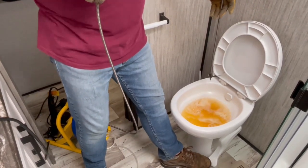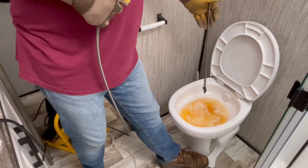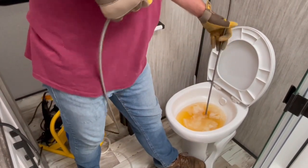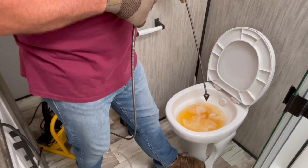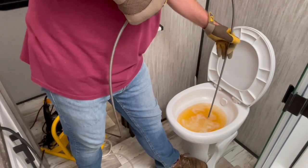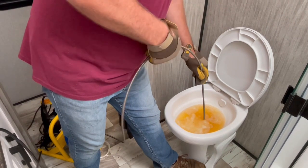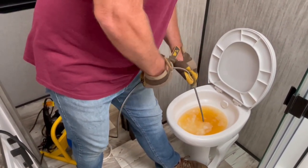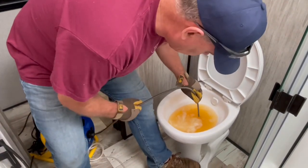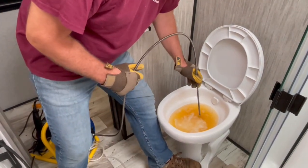The water is fully open right now as you can see, and it's stuck. I'm going to put in the spearhead — that's what I'm using, fastened on nice and tightly. I'm just pushing down, going further, and I feel like I already went through some of that backup. I may need more cable — I'm surprised I actually just broke through some of the blockage.